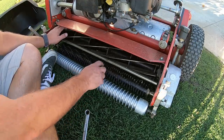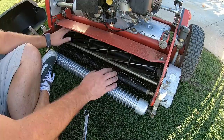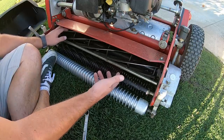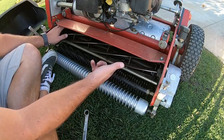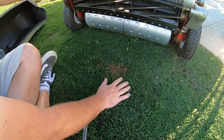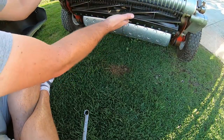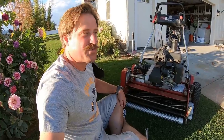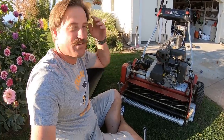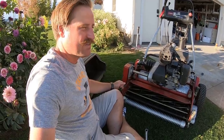When the reel is on and it's cutting, what the groomer does is comb the grass. This roller here will fold the grass over, and then this roller — the groomer — will comb the lawn and lift it back up in preparation for the reel to cut it. After it's cut, you've got the roller that flattens it down and rolls it over. So it rolls it over, then this lifts it up, this cuts it, and that rolls it. This is the first machine I've ever had with a groomer, and the first time I used it I wasn't widely impressed, but I'm going to try it again and see how it does.